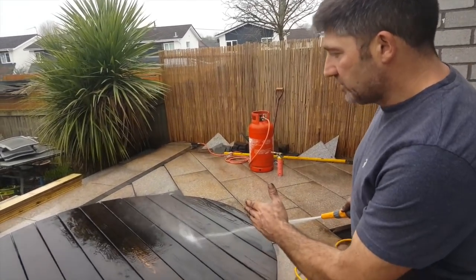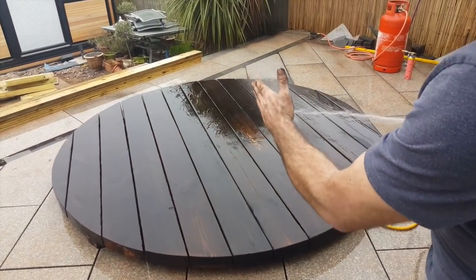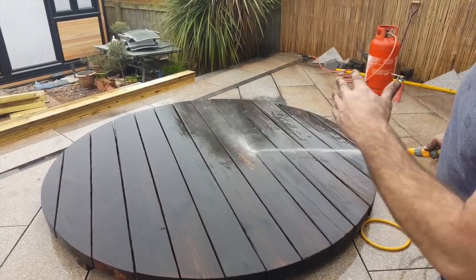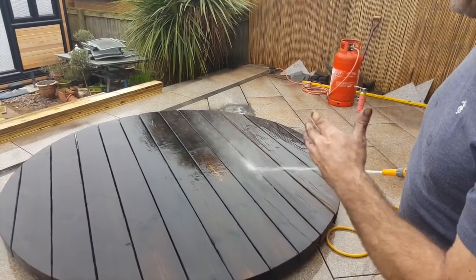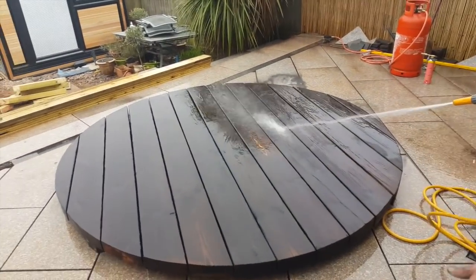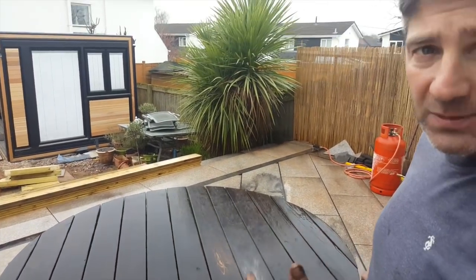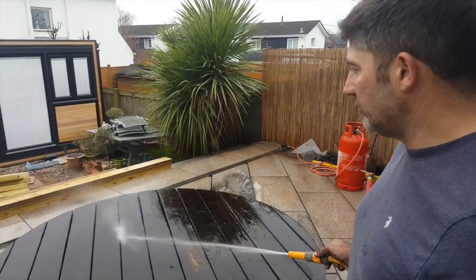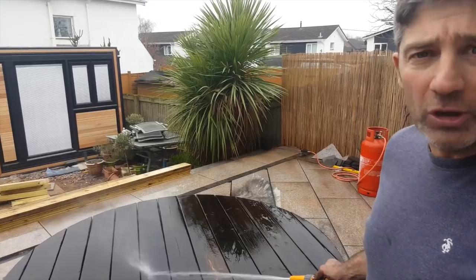If you look down here, I didn't have much of a gap beforehand, but as you can see I've burnt the edges. Now it's revealing the gaps in the wood, giving that period look. The wood's very undulated — it's not straight like it was before, and that's what gives it that aged look. So if you're after that sort of look, you've just got to keep going until you get the look that you're looking for.